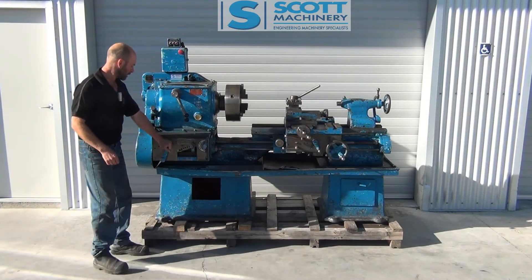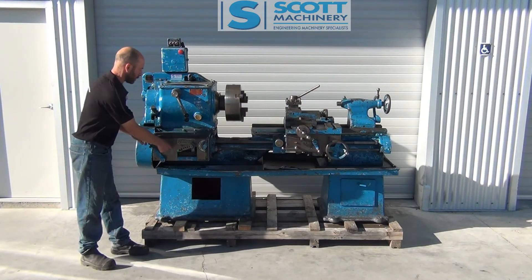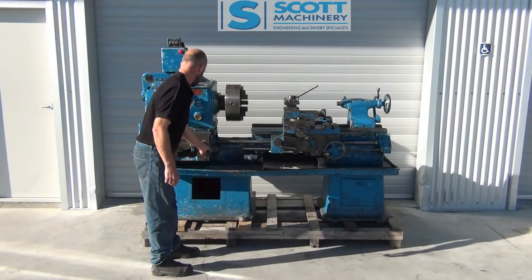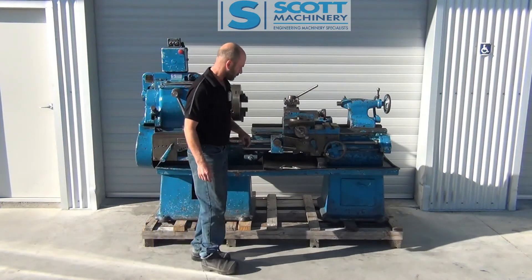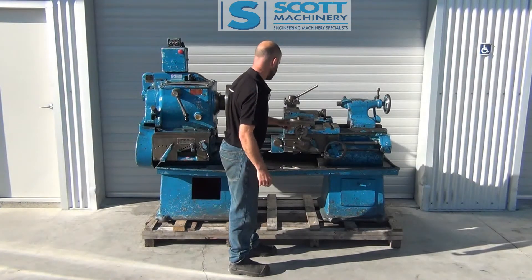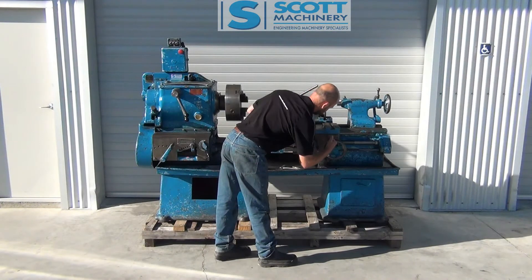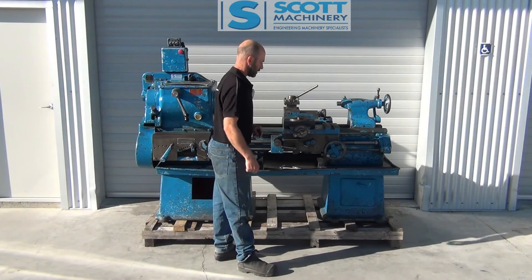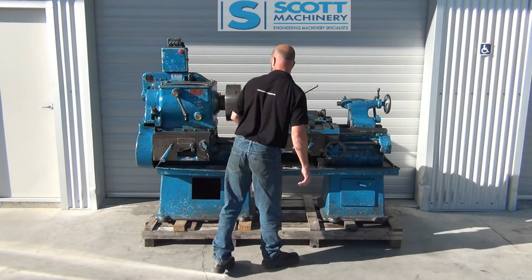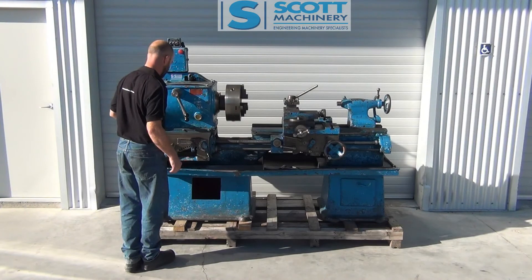With the feeds, it's working in the far one, not the next ones — basically just the two extremities. The range is working through here. I'll put that onto the feed and run through those feeds. I've engaged the feed to the cross slide coming out towards you — I'll stop that and put the feed onto the carriage, coming towards me. Those feeds seem to be engaging all right. I'll put those feeds in neutral and run through some of these gear ranges.